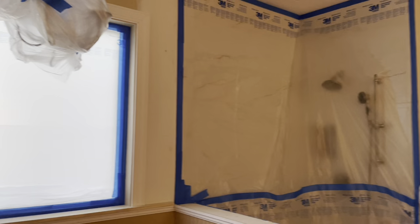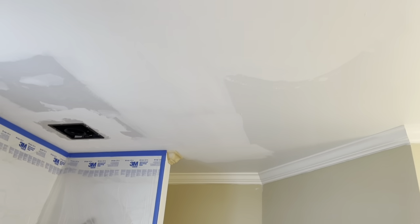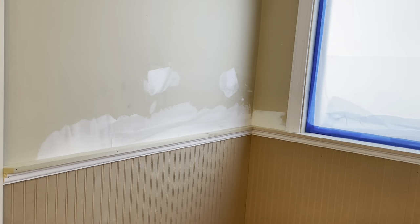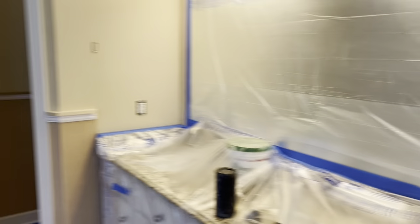We've got the chandelier covered, the windows, and the shower, and now we're ready to start sanding. I'll sand this ceiling where they've done some drywall work and some patches that I'll have to sand and re-spackle. Same thing over here. Then we'll get that all cleaned up and then we'll caulk and putty. Got that place sanded — we'll just give it a minute and let that dust settle before we go back in to do some caulking and putty.